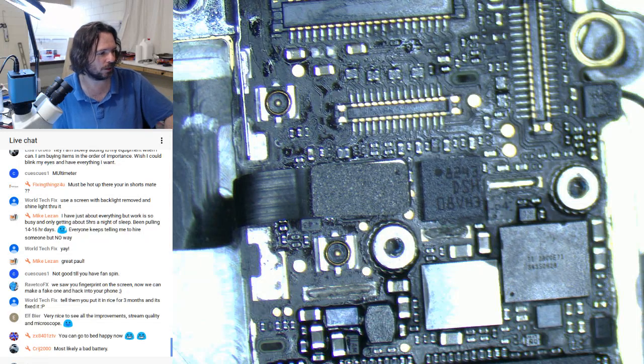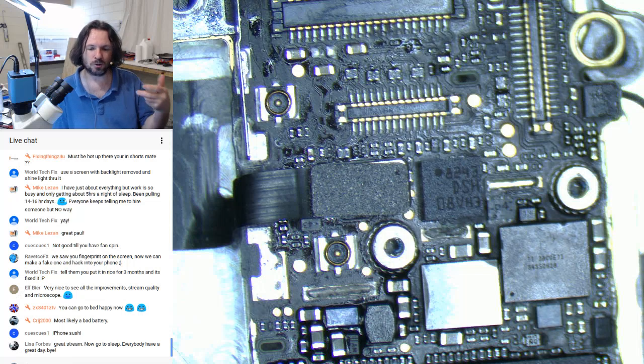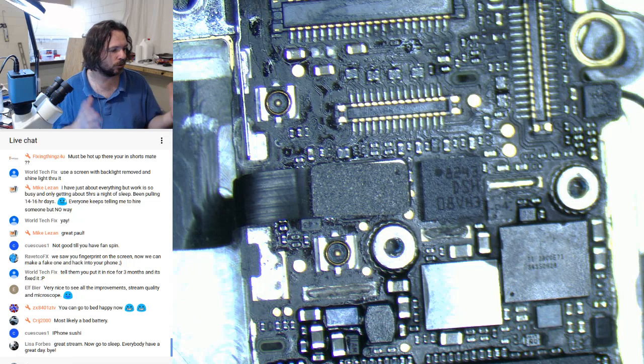Cryo, most likely a bad battery. Yeah, I'm thinking so, because when I look at the... I've got the screws in it. I don't want to take the screws out this time of night. It looks really crusty and nasty. And like I said, it was soaked in red wine. I was able to take the whole MacBook main board out and put that through the ultrasonic, but I couldn't do that for the battery one. I tried lifting the daughter board off, but you can't seem to do it without first removing the main pack from the laptop itself. Can't win.